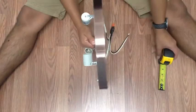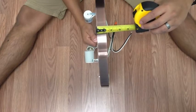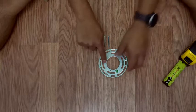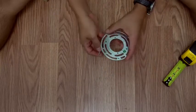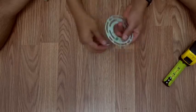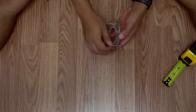Next, we're gonna measure the height of our canopy — write this number down, we're gonna be using it later. Now we're gonna install the canopy screws and hex nuts onto our mounting plate. When you install these canopy screws, you wanna make sure that the screws are pointing towards your ground screw.